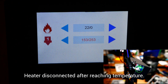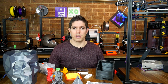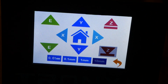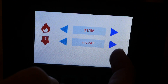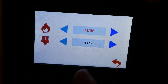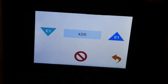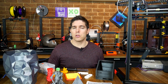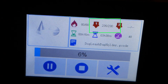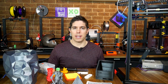I have no idea how this is still occurring in 2020. The LCD screen is also quite counter-intuitive in some places — the pre-heat layout is strange, having the heated bed first, and temperature steps go in values of 3 degrees. The filament load and unload screen is not labelled well at all. I also noticed the printer appears to have no PID tuning done on the hot end, so temperatures fluctuate wildly — 5 degrees either side of the target during a print. At one point while printing PETG, the temperature dropped enough to cause a hot end clog.